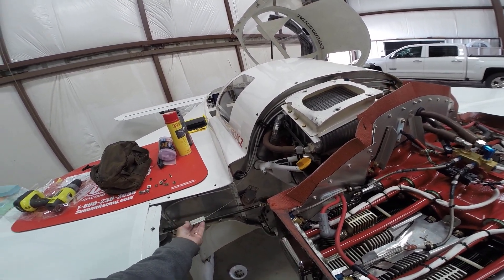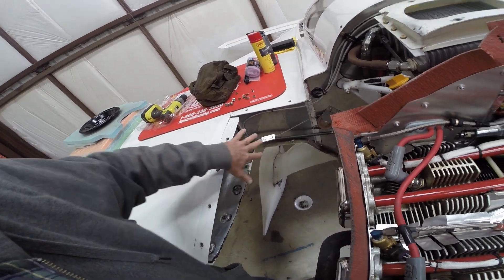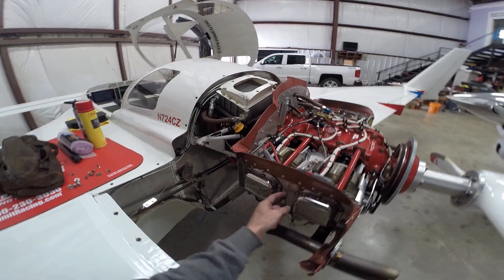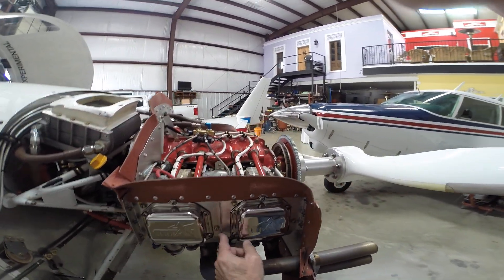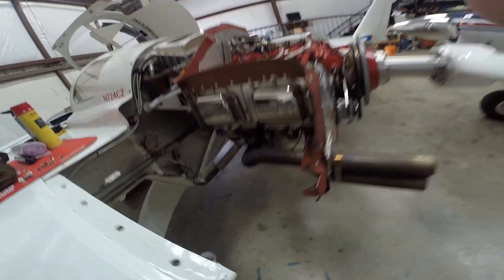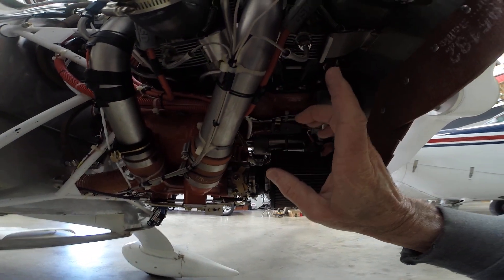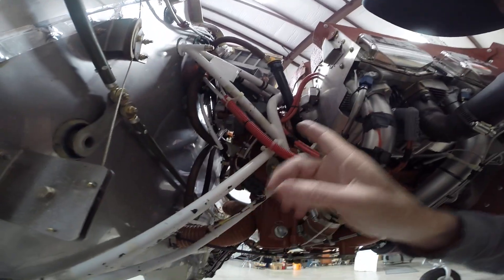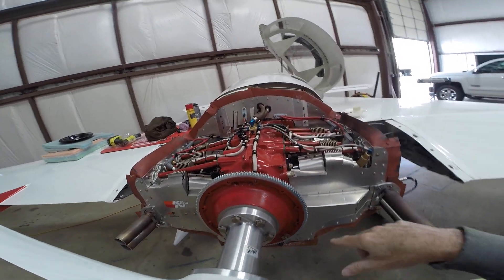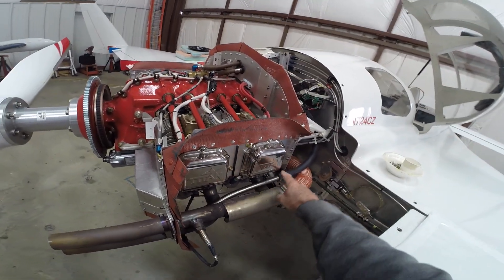There's a little connection for the rudder cable. I've used Thermotech heat insulation to protect the wing roots. I had to modify a part right here because it had cracked — I put a 90-degree bend and backed it up with fiberglass. The other one cracked around 130 hours right at the same spot. There's the SDS throttle body, a K&N filter, belt-drive alternator, pad-drive alternator — the coils are mounted where the mags go. There's a Saber 8-inch prop extension, a Catto prop, 60-pound Bosch injectors, and a heat muff.